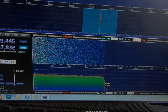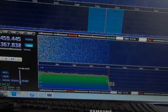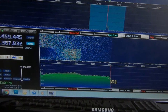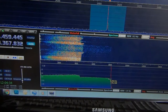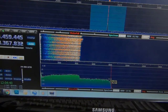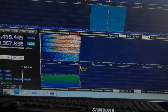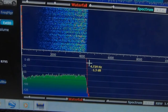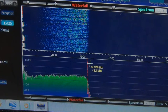Here is HDSDR. I've tuned it to 34.367 megahertz. If I turn on the power — there it is. It's a very very low signal, but let's handle the antenna a little. Yeah, the carrier is very very narrow — about four kilohertz wide. It's not that much, but if I touch the other wire it goes nuts, so I think it's an input.